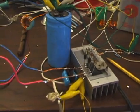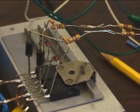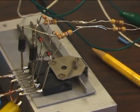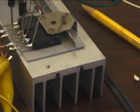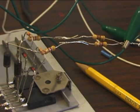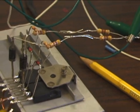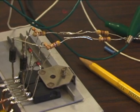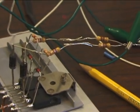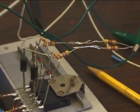I then send the 48 volts over here — this is my ZVS driver circuit. I'll zoom in on it. There's the two diodes, the zeners, the resistors, and the two IRFP250 power MOSFETs which are attached to a heat sink. You'll notice on the top I've got two 470 ohm resistors in series. If you're going to run over 35 volts through this circuit you're going to want to connect two of those in series, or you could just use a 1k resistor. The 470 ohm resistors are too low for high voltages and you'll end up blowing your zener diodes if you don't use a high enough value.